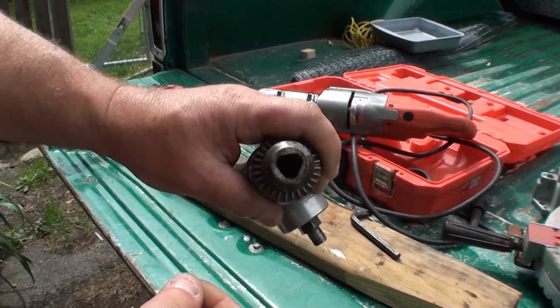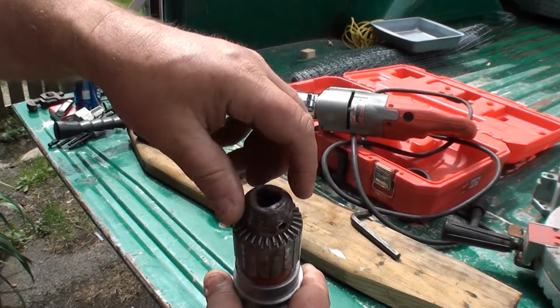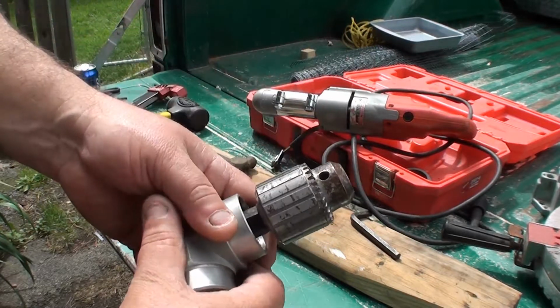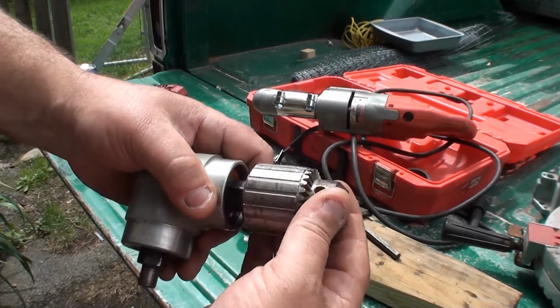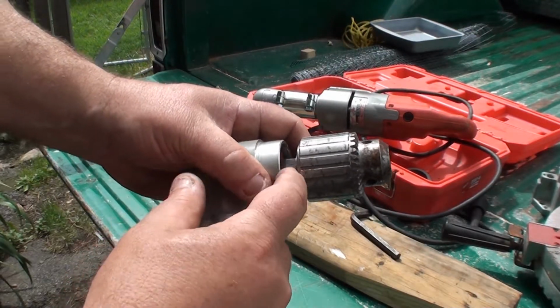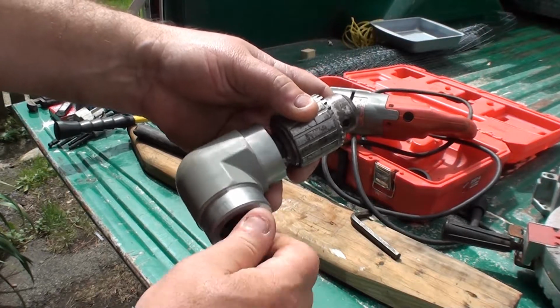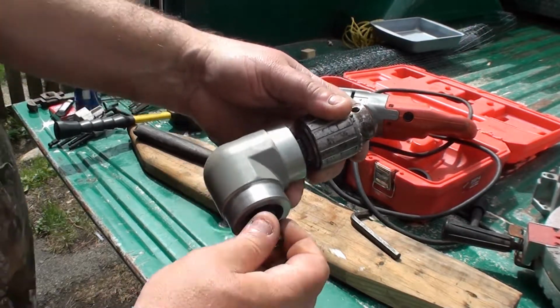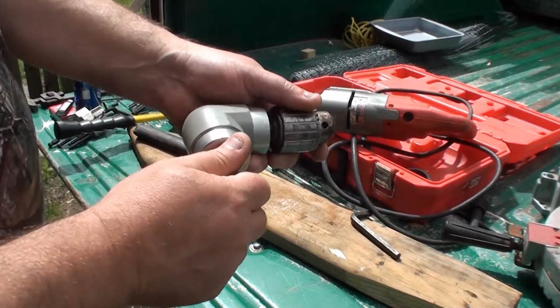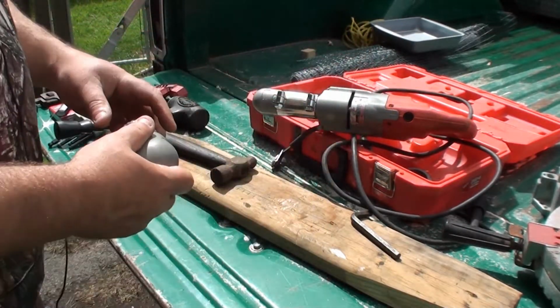Busted it off, trying to take it out as a regular right-threaded screw or bolt, and then thought the whole chuck was probably on there left-threaded, and continued to reef this down on here, trying to pull it off as a left thread. And that's how I think that this broke. Because you're not going to break these gearboxes on these 90-degree drills. I mean, they don't turn fast enough. I think you would break your shoulder before you'd break the gears in there.